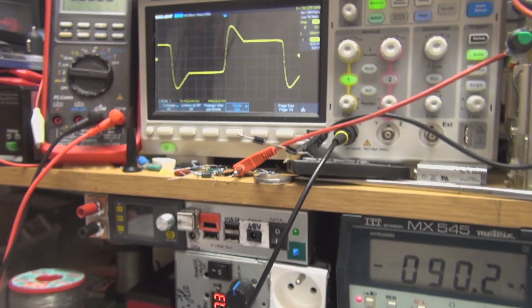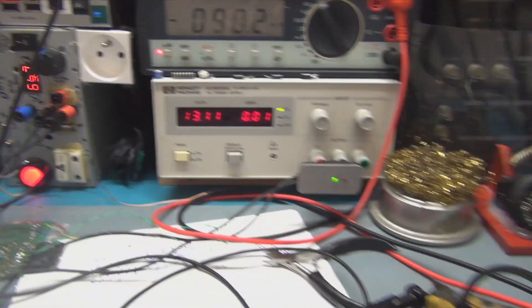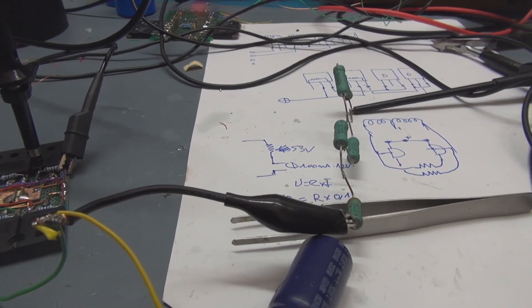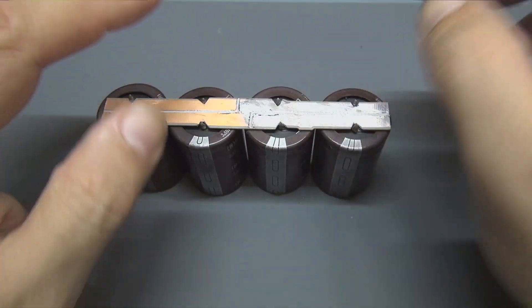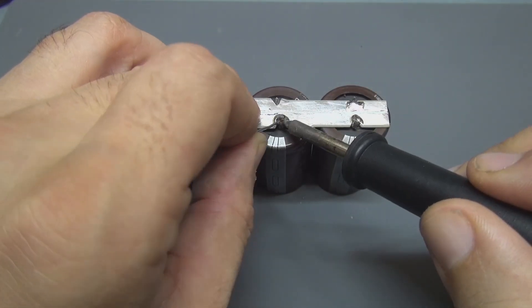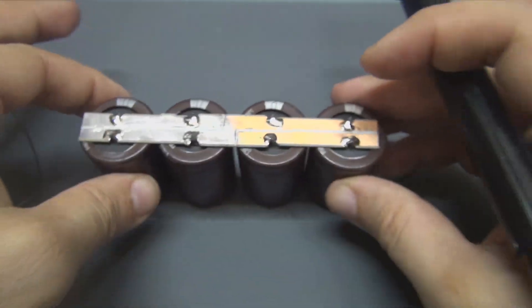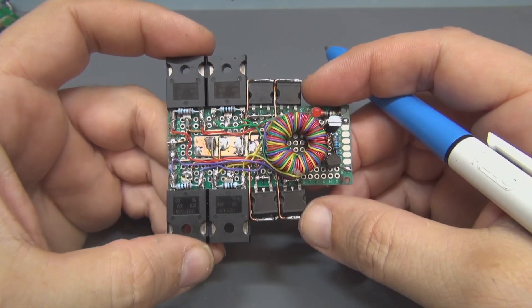First I was using a resistance network to provide energy with 65 volts, but it spent a lot of energy supplying this device because there is a big loss of heat and voltage on it. The most important thing in this project is the capacitor bank — you need a very nice capacitor bank with the voltage corresponding to your project. This project has a very wide voltage range, and the voltage they can handle is just about your output capacitors, which are able to provide 200 volts here.